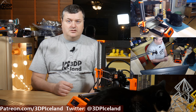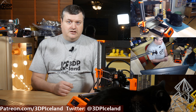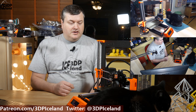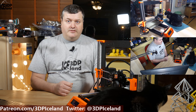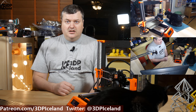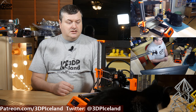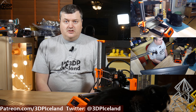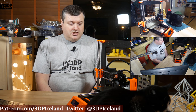Also the stepper drivers on the new board, the NC board, are designed in a way that they don't need any end stops. They sense the movement, and when there's a resistance in the movement, it's picked up by the drivers, and they can pick up where the end of the movement is on the bed and on the printer. So they sense it without any end stops. That's a great feature to reduce the number of wires that you have to connect and switches to take care of. So that's a very good feature.